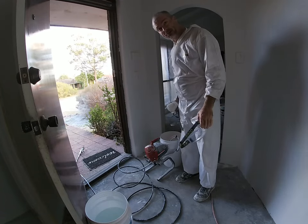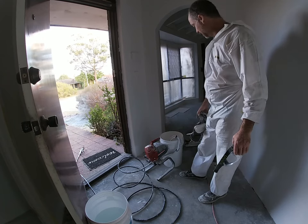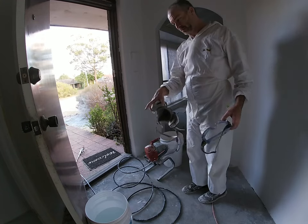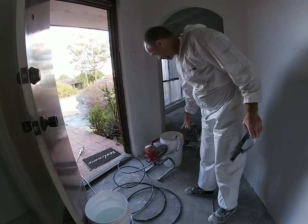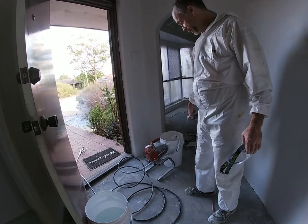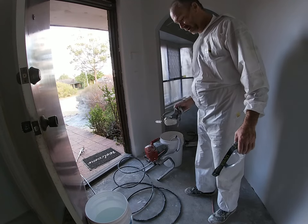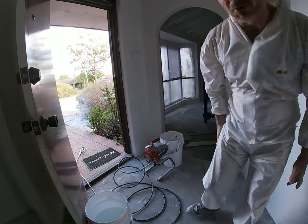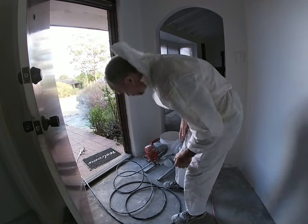The last part of the job is cleaning the machine. What you've got to do is run it through some fresh clean water. I've got some murky water there which I've already run through it. I'm going to swap to fresh, then separate your return line and collect — you make sure you go from fresh to flush. You'll get a milky water, then just keep going until clear water's coming out. Then you can clean the gun by just blasting it out. So that's cleaning the pump: clean water in, murky water out.